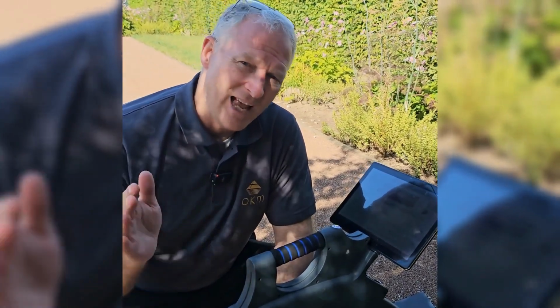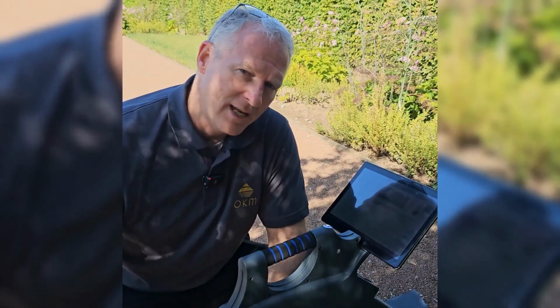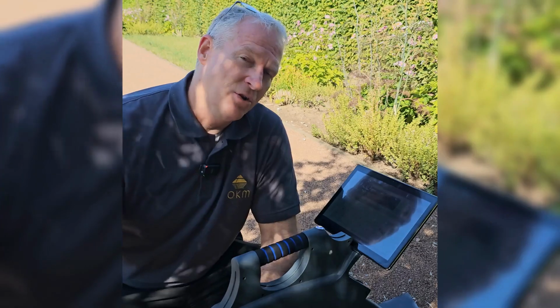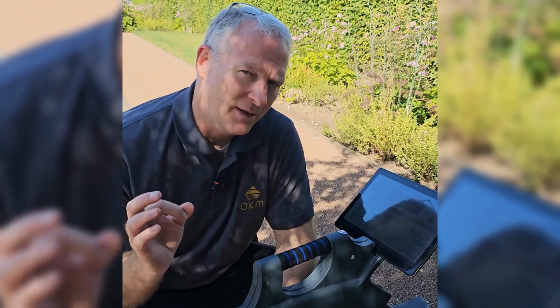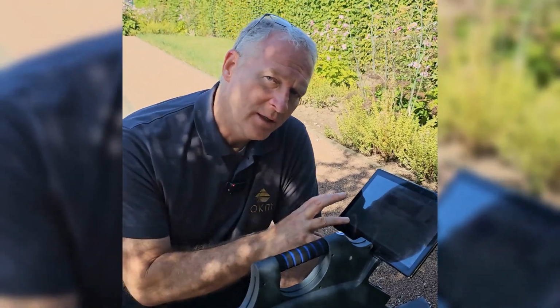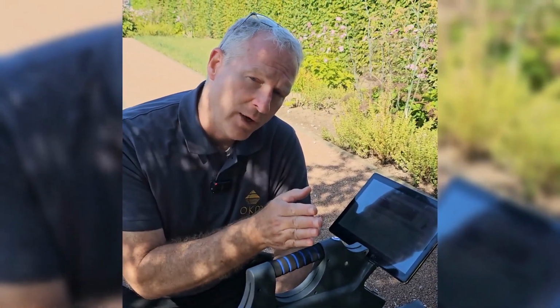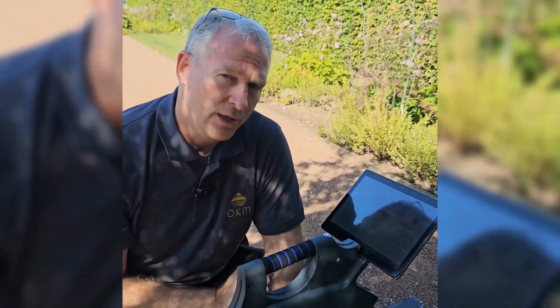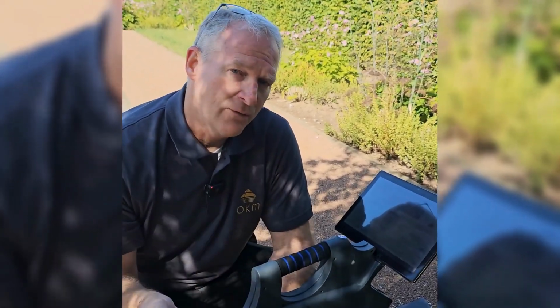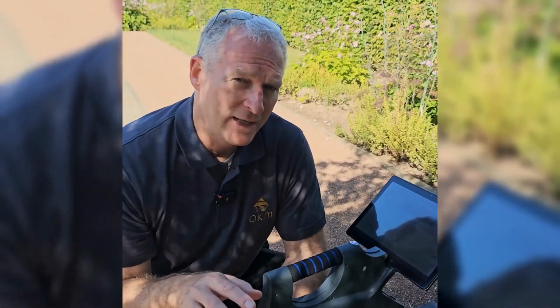The best thing to do is to actually map out your scans before you start, to say, okay, I'm going to do 10 scans, scan 1, scan 2, and you know where those are so that you can go back and reference it when you do find a target to know exactly, okay, this was scan 4, and then when you look at the Visualizer 3D Studio, you'll see it was 3 meters from the starting point over and then up another 2.5 meters, whatever that target location is. But the more specific you are and the more preparation you do on the front end, the much easier it is to find the targets that you've located with your device on the back end.